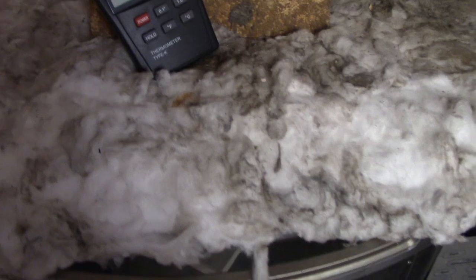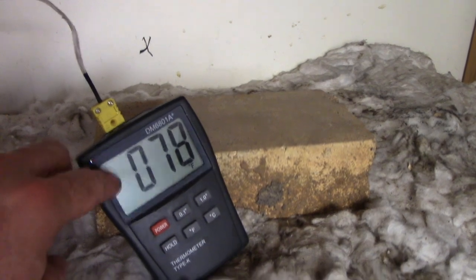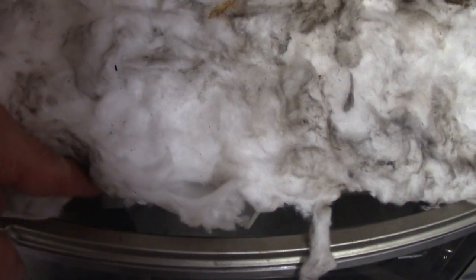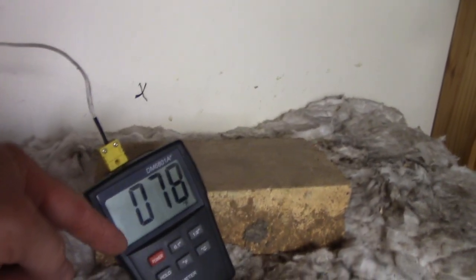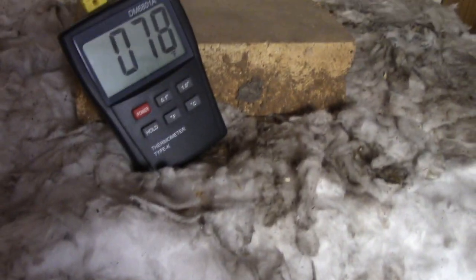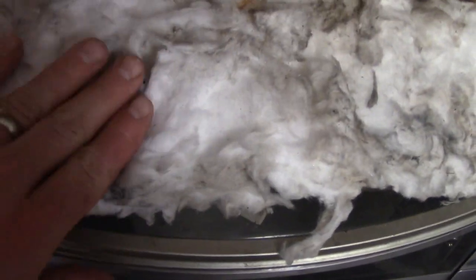What this allows me to do is, as the tempering cycle is going on, if I notice on my thermo gauge here that the temperature is rising too much, all I have to do is use my finger here and create a couple of vents, and that will bring the air temperature down slowly inside around my blade. And then as the temperature starts to fall, if it starts to get a little bit below the temperature that I want, then I'll drop that insulwool back down, cover up the gaps, and the temperature will go back up. So that's how I temper my blades.